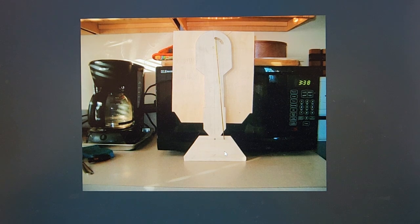And that's pretty much how it works. But the problem is the leg-to-body angle is different from the leg-to-foot angle. So the distance between the pivot point and the tie rod end of the foot has to be about twice the distance of the pivot point to the tie rod end of the top.